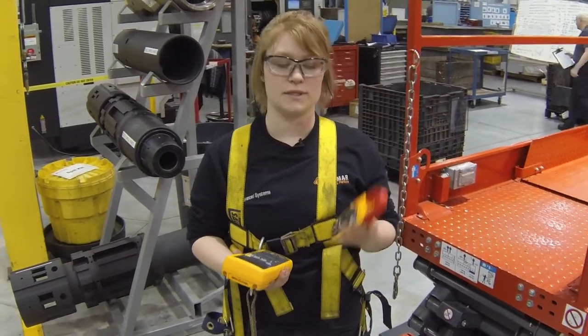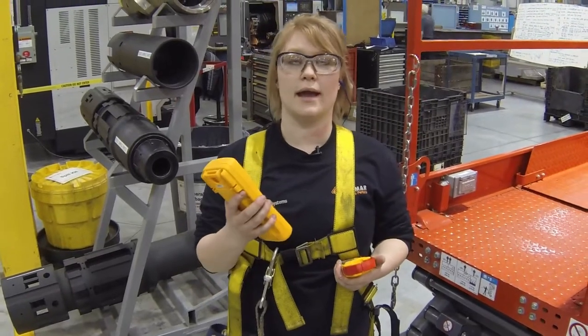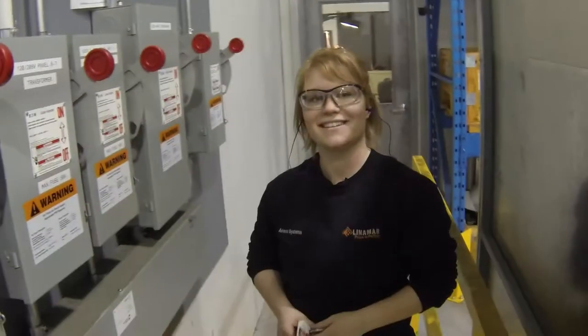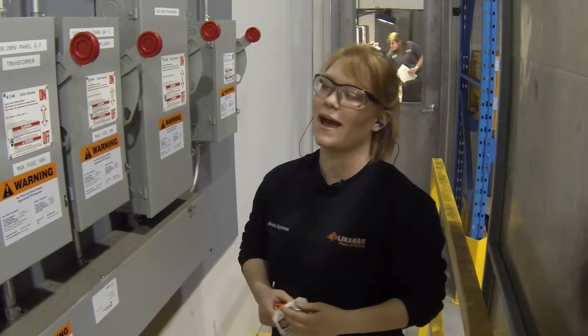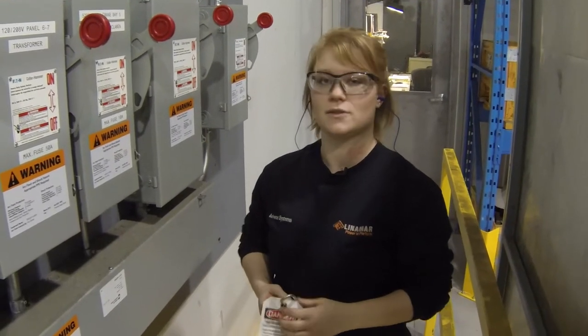By doing this, I have to attach this wireless module to a box up on the overhead crane. I'm going to be putting it on a motor contactor to test this current. I'm locking out the overhead crane in bay 5 so that I can safely work and attach a current clamp to do some testing.